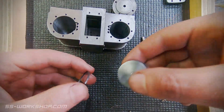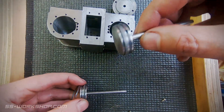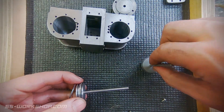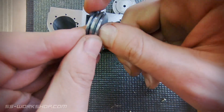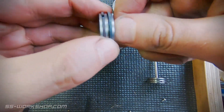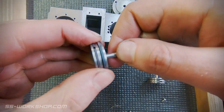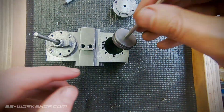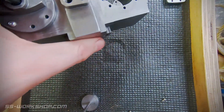And now we're ready for assembly, locating the piston rings in their grooves. The piston rings will be loose to fit now that they've been expanded, so the task doesn't require any special tools. You can just do them with your fingers and they'll snap into place. One note: the joints should be misplaced by 180 degrees. The next task is to fit them into their cylinders. I used some WD-40 to help with the trial fit, which will need to be steam oil in the final assembly.